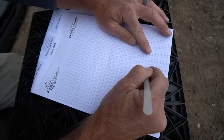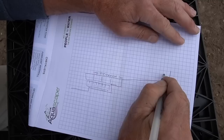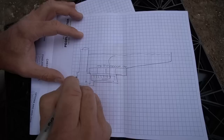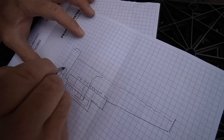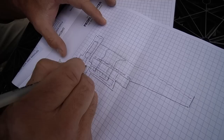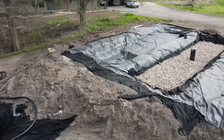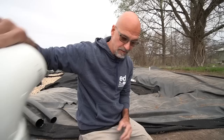There's a lot of biological activity there. The water then comes across and goes down through another snorkel-centipede system on the other side. The area for the palapa — the pond pitches slightly — we have aqua blocks coming across, river rock on top, and the water level is up high. Water goes down into the big snorkel vault on this side, a vertical stack coming up. I'm doing a connection with a flange connecting to the rubber liner with an elbow coming out — all four-inch — opening up to a six-inch pipe that comes up to water level, then flows down through everything into the centipede module and into this vault.